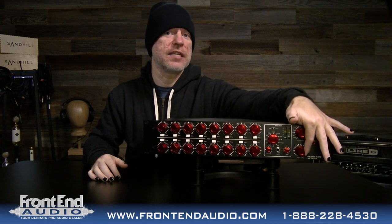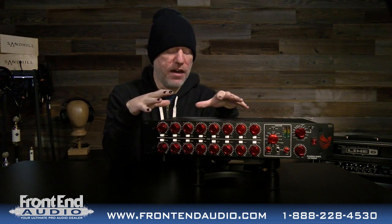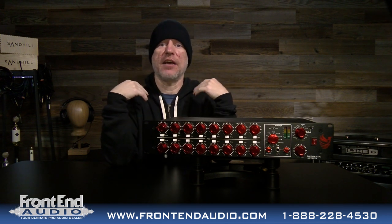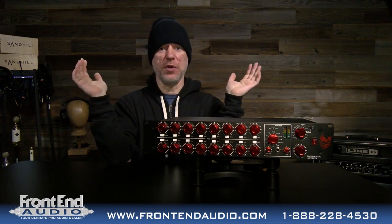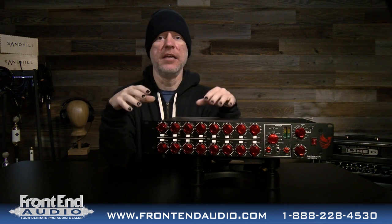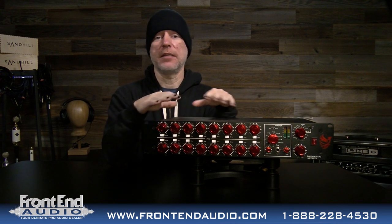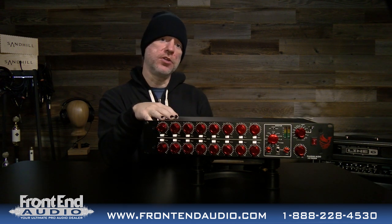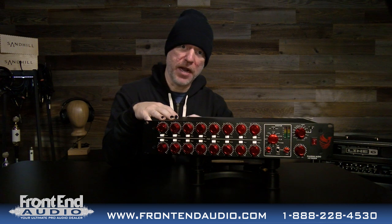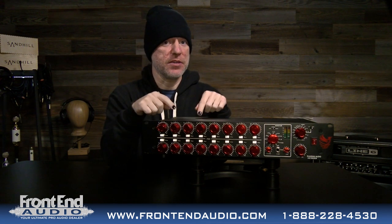Your main output is totally variable, so you can dial in and fine-tune things. Overall, this gives you a ton of analog summing capability — it's not just about front-to-back depth, stereo width, headroom, punch, detail, and saturation, but the culmination of all of that with that signature Phoenix Audio sound and build quality. If you want it simple with DB25s, get this version; if you prefer traditional balanced XLR inputs, go with the MK2.